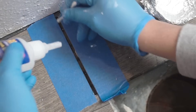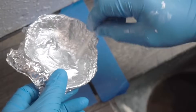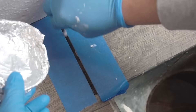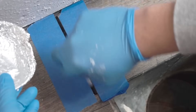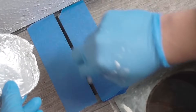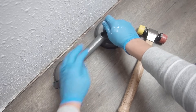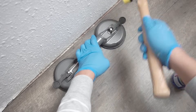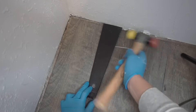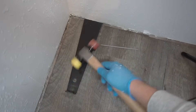After you do that, spray a little bit of the activator — be very fast because it'll start drying and evaporate. Apply that activator on the other side with the Q-tip and then start putting this together. Right after, tap this to the end. You can use the suction cup to tap it back in, or if it doesn't shift, use the pull bar that comes with this mallet kit — I'll leave that in the description as well. You can tap it with the mallet to close up that gap.